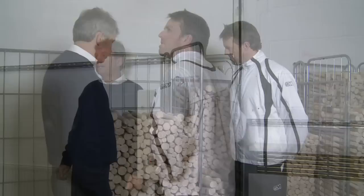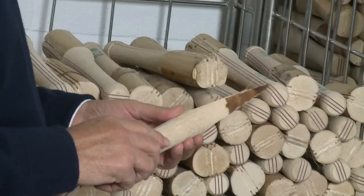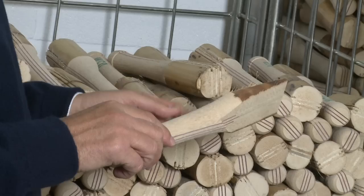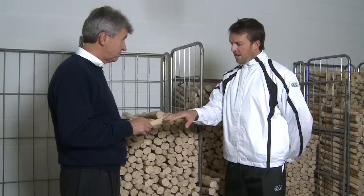The other major part of the bat, of course, is the handle. It's just as important that we keep the moisture content of the handle stable as it is the blade. When the handle goes into the blade, it's cut and spliced into it. If this was at 20% moisture content and the blade is between 8 and 10% where it should be, then this will shrink in time and cause problems on the glue bond. So it's just as important that this is at between 8 and 10% as the blade.